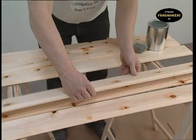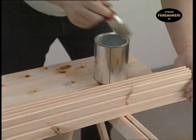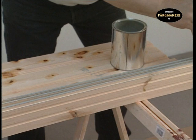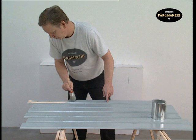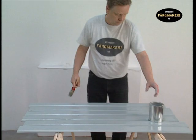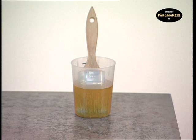Collect up the panels and paint the edges. Avoid dipping the brush too deeply — the paint covers well and too much paint will cause it to run and be uneven. We're using an oval primer brush to access all surfaces of the panel. Work the paint well into the substrate using repeated long strokes of the brush. Keep the brush in raw linseed oil between the coats to avoid it drying out.